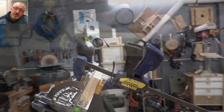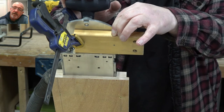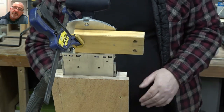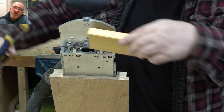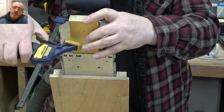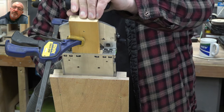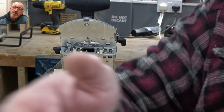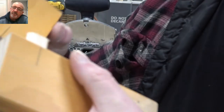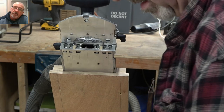So here's a bit of a demonstration. We've basically put a pencil mark on two pieces of wood — one line one way and one the other — so we're actually creating a joint. As you can see, the machine is doing its job. Same again with the joint component, and we're only going in 15mm here, so we're quite safe. And there we are — that's the joint cut in one side. Put it together — there you go. Perfectly level. Exactly what we're trying to accomplish.